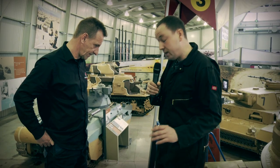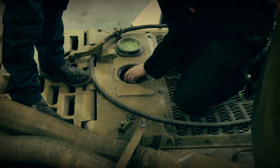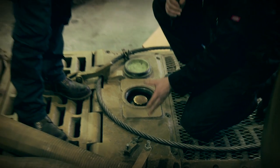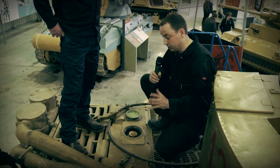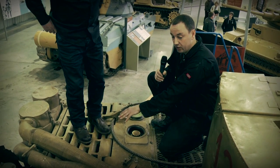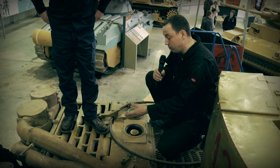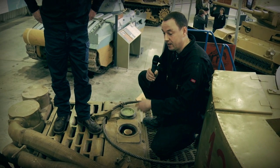Carrying on with the first parade on the Tiger — the coolant side. Either side of the rear of the tank are two radiators. To check it, we undo the cap and check the level of coolant, making sure there are no leaks and no damage to the radiators. Underneath the grills where Richard stood are the coolant fans — there are two fans each side. On the first parade those will be lifted and we'll inspect the fans for any wear, any damage, and make sure they're moving freely.